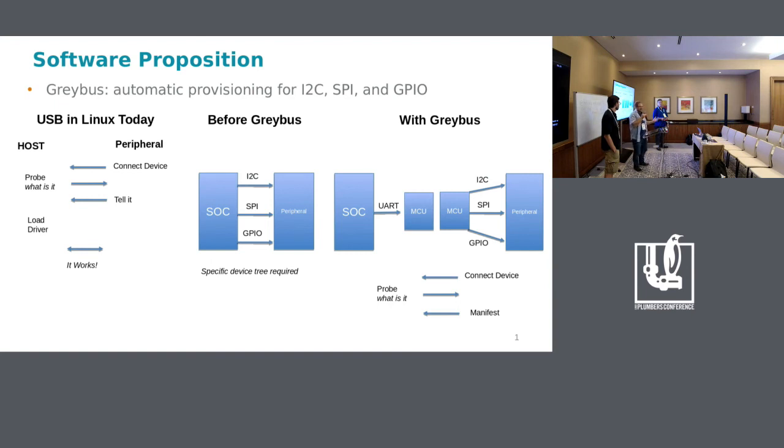We were gonna have a demo today, but we're just doing it over UART right now, which isn't much of an advance. It's the same thing that Alexander had demoed, just on a different platform. So we're using the CC1352R, which is both BLE and 802.15.4. So you can run these radio protocols simultaneously.